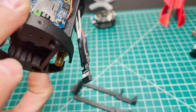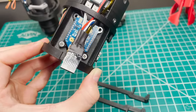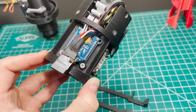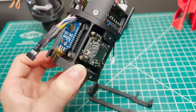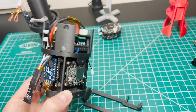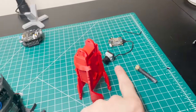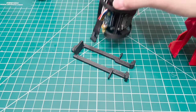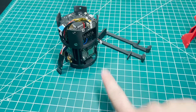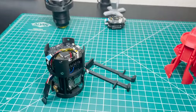And I'm trying a new technique where I put a giant heat shrink tube around that. And then I put a bunch of epoxy in the top and bottom to make sure that there's no stress on the leads that are soldered directly to this connector PCB. So this guy's done. Our next steps are to assemble our upper avionics assembly with our camera. We also need to attach our radio and our wishbone, which is right underneath here, to the lower avionics assembly, and then mate those two with these four screws here.